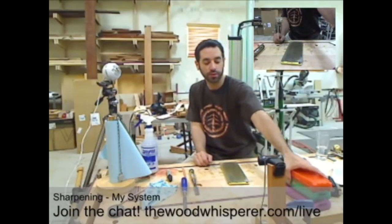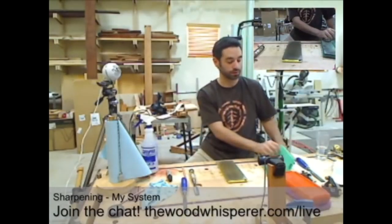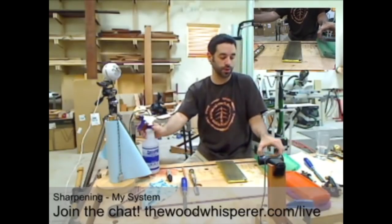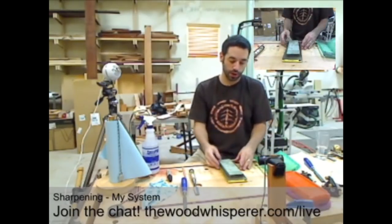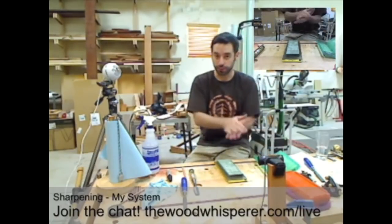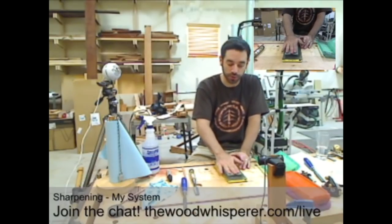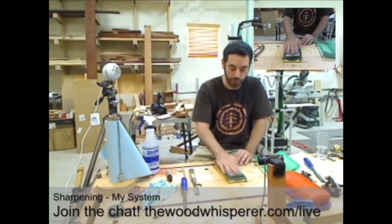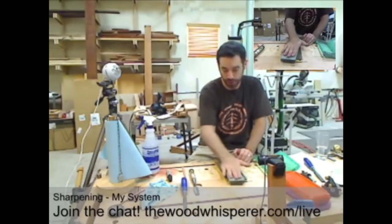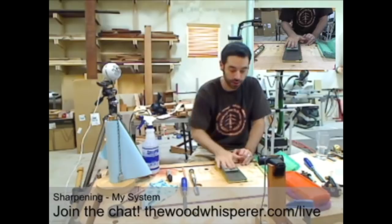I don't want to contaminate one stone with the grit from another. So basically what I do is take my DMT stone, I lay it down flat on the table, make sure it's nice and wet, soak it with the hose, and then I take my stones, drop them on the surface. And remember I was talking about how the flat end of the chisel sucks down to the surface. Well, the same thing really happens with your stones. So you can just push them forward and back, in nice long strokes like this. And you see I like to angle it one way and the other, just to help promote even wearing.